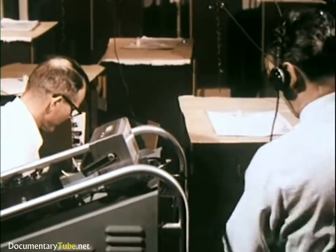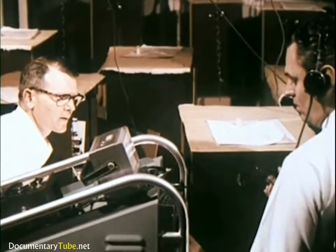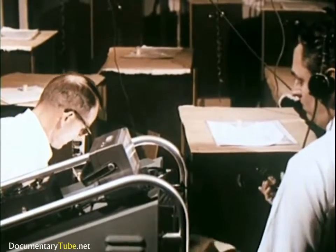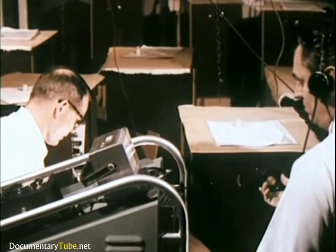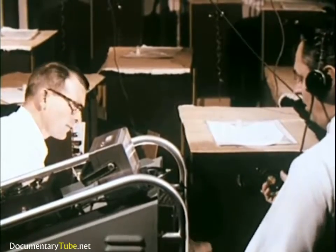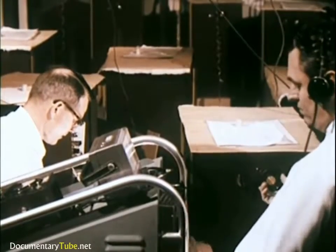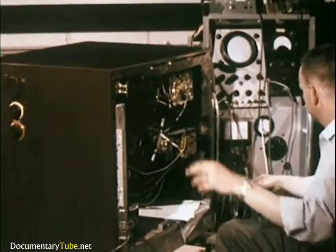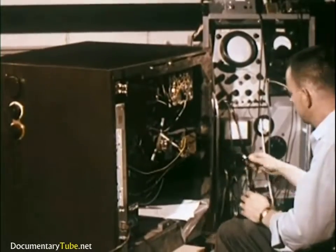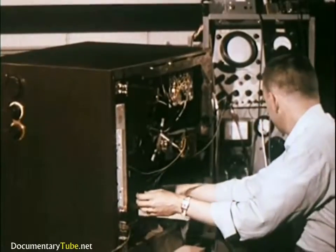Samples of finished sets are selected for the life testing laboratory, where they are tested from 50 to 2,000 hours. The sets are continually turned on and off. On for 105 minutes, off for 15 minutes, to subject them to alternate heating and cooling off. Throughout the tests, technicians using sensitive testing equipment keep a close clinical report on the action of each set.